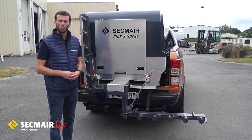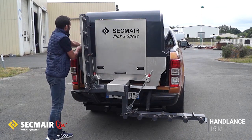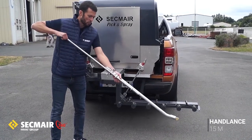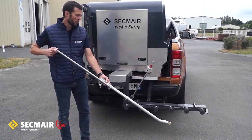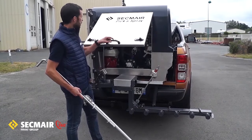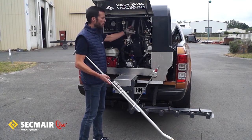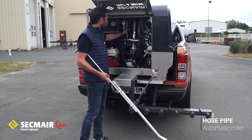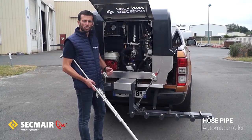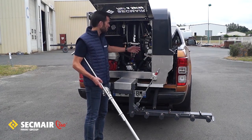Pick and Spray is provided as well with a hand lance. In my case, with the module fitted on a pickup, I have decided to store it on the side for easy access. This is a foldable version, unlike what we are used to fitting on bigger machines, and you just need to fold it to have the hand lance almost ready to use. Once folded, you open the module and connect it via the fast coupling to the main 15 meter hose pipe. Note that the hose pipe has been fitted onto an automatic roller to facilitate its use. In case you cannot store it on the side, you can also slide it inside the module, which is designed for such.